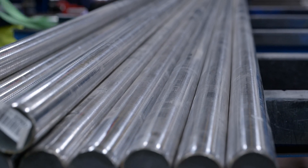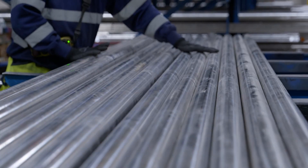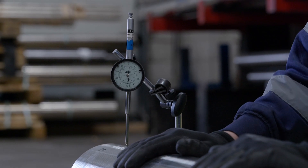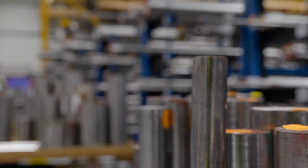Brilliant. How did you achieve the highest strength? What's it actually made of? It's about 85% copper, which gives you that resistance to seawater and resistance to fouling. But to push the strength up, you put some nickel in there and a little bit of tin — so it's effectively a bronze alloy. There are additional, very small additions that form precipitates and through the production process help to age harden and strengthen the alloy. It will achieve that strength almost irrespective of the diameter of the bar or section thickness of the component. Even though it's an older material, it's had a bit of a renaissance in recent times due to its ridiculously high strength.